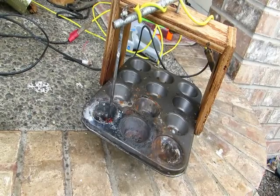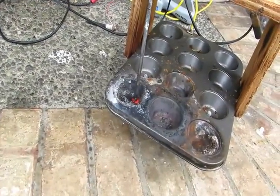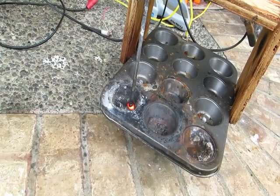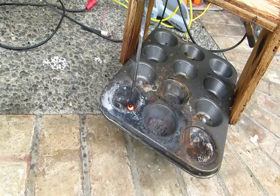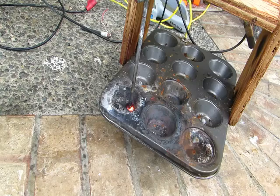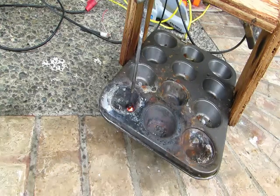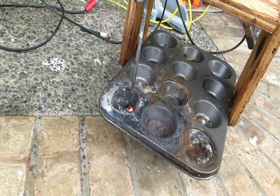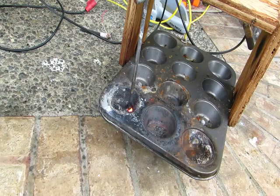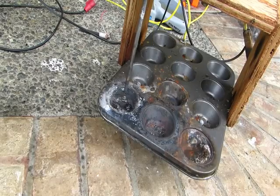At this point it's molten, and the current is enough to keep it molten. You can hear all the popping that's happening as it's electrolyzing — it's rapidly electrolyzing at the moment, very hot, and it's keeping itself molten in that one area. Hopefully it's producing some calcium metal. My electrode was very clean, so when we stop this we should be able to see if it produced calcium metal. Once my battery charger pops — because it's drawing a lot of amperage right now — there it goes. We'll remove this quickly and check it out inside.